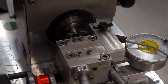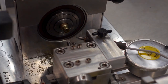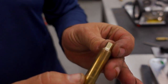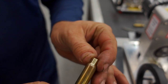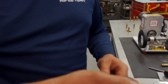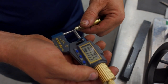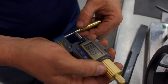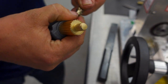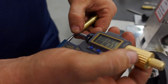You see, we come there, depends how much you want to cut into the shoulder, feeds as it's coming back, and you can see the cut we have there. So if we check the thickness, you can see we're getting where we just didn't quite clean up there, so we would adjust that out a little bit on this machine.